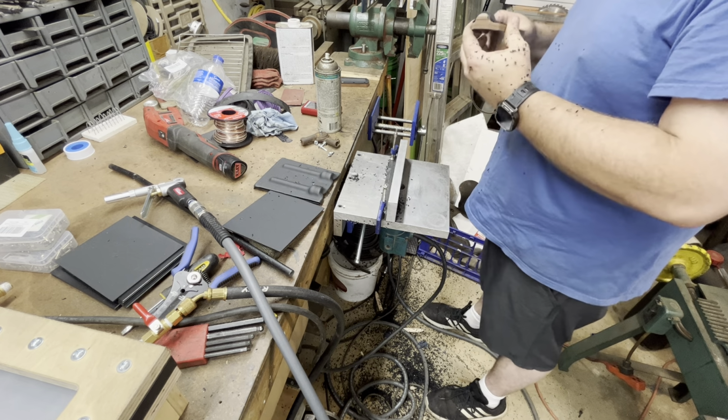I got a little flashing to kind of peel off with my fingernail here. But let's go ahead and take this over to our screwdriver and make sure we were successful here. So in this particular model of screwdriver, the 3/8 nut driver side is the widest. If this is not put together close to perfect, let's see if I got... yeah, this one starts to bind up.